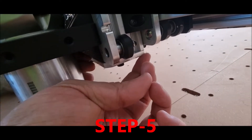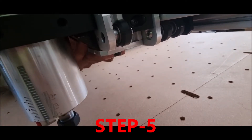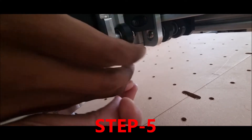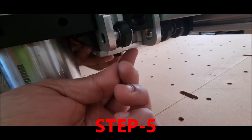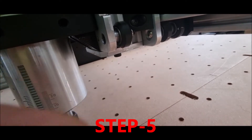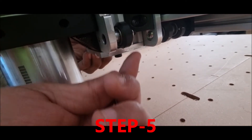You can see that the plate is not yet flushed. When you push the C-beam up, do a slight adjustment and feel with your fingers so that the plate edges are flushed with each other. Also confirm that the two back screws are fully fitted in their slots.